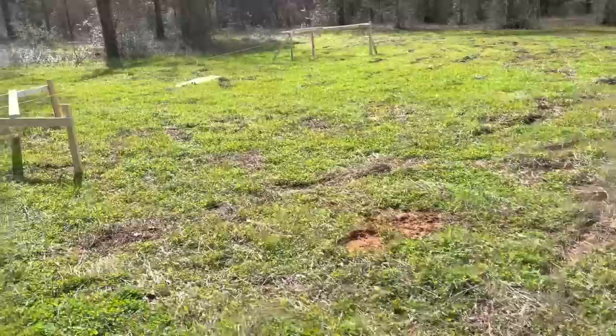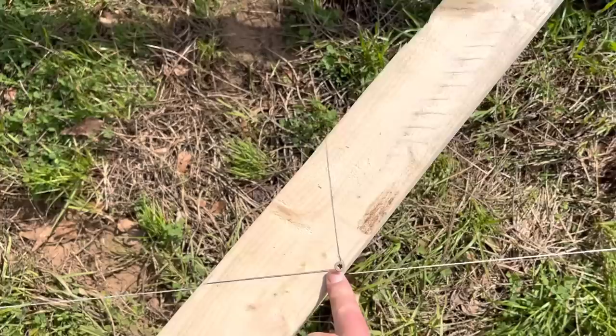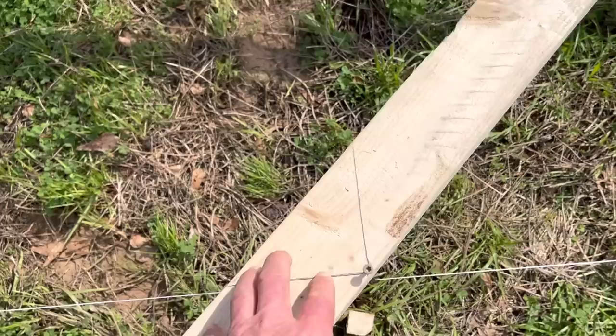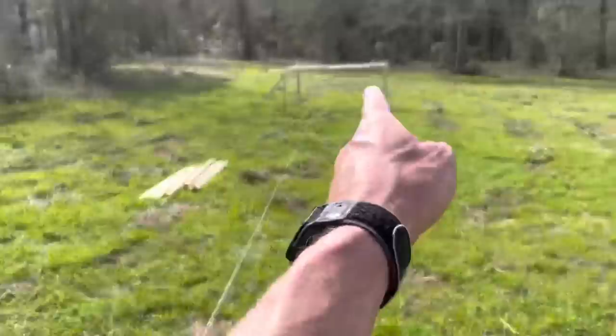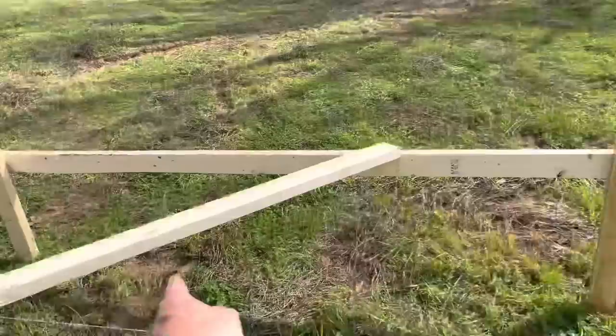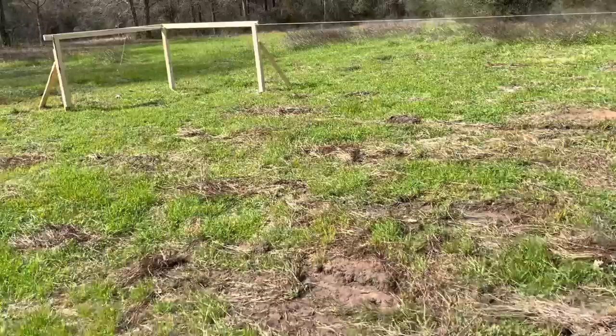So I've established where I wanted the front corner of the house — right there. That's the front corner of the house. I pulled 48 foot, and the reason I've got this here instead of just making a mark on the line is because I can't hold it, so this is going to help me hold the tape. I pulled 48 foot down there and did the same thing, ran that little diagonal piece across there, put a screw in at 48 foot. So take the tape and pull off of either corner — it doesn't make any difference. I pulled off of that point right there across.